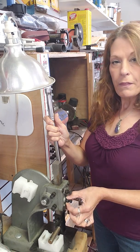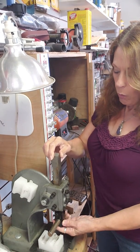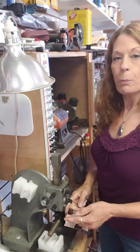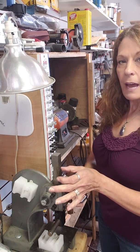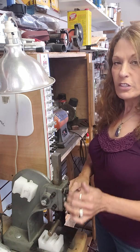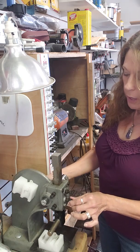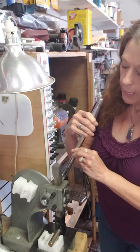You'll notice there's a bolt and then there's a nut. If it's not adjusted and you get wobble and play in the ram — this is what we call the ram — if you have wobble and play in the ram, it puts unnecessary force and tension on the screws. If that attachment is to wobble or to turn at all, it puts pressure on the screw which damages the threads that the screw goes through. Then you can no longer tighten up the attachment on your bender. So you want to adjust these screws, both on the front and on the side, to where you do not get any wobble any longer.